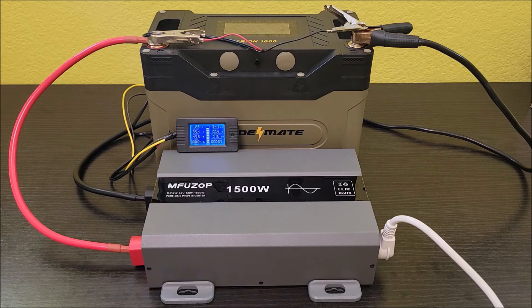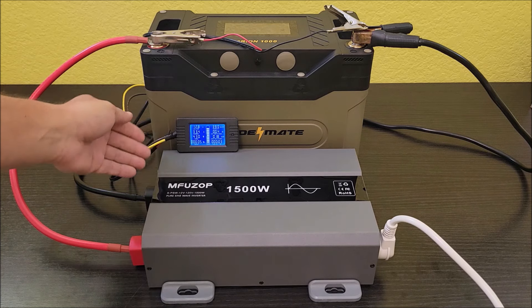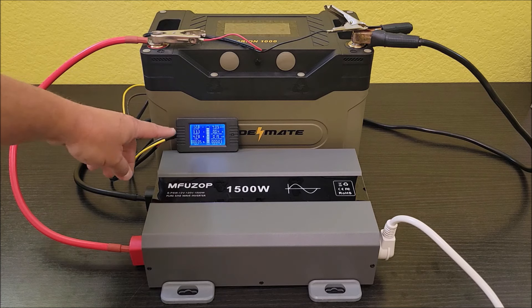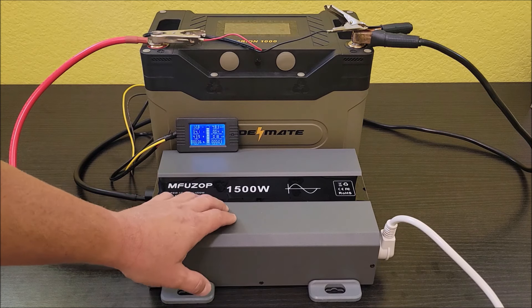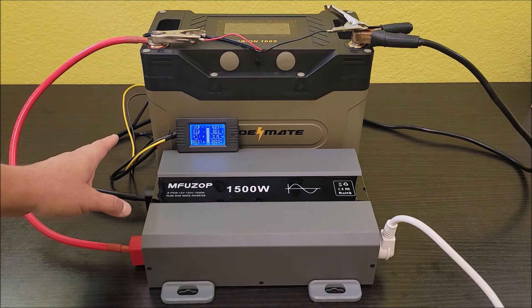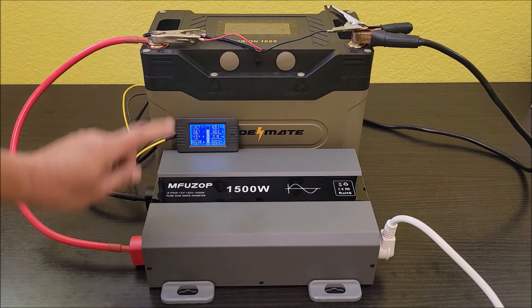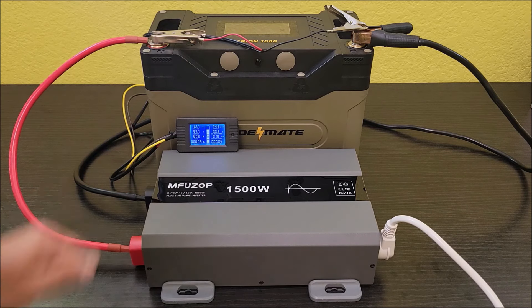There it went for a very short period of time. You could see it did go up into the one-point-something kilowatts — it probably went higher than that, but that's all I was able to see, about 1.5 kilowatts when it kicked. This inverter is more than powerful enough to handle this air conditioner, and the battery is rated way more than it needs to be to run it. This should be a good test to see how much power gets pulled out of this battery down to basically its cutoff rate.